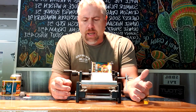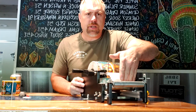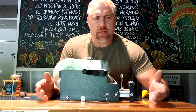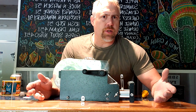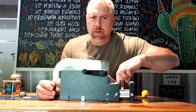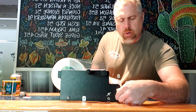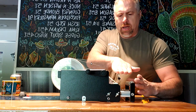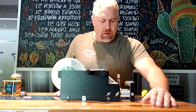Sometimes you have to change the width of this unit. If you're going from, say, a 12-ounce long neck bottle to a 22-ounce bottle, the bottle is thicker and you need a bit more room. That is so easy to do — there's a wing nut on both sides. You just loosen them up, slide this in or out until the bottle sits just where you want it, and tighten them back up. That's the easiest adjustment of all.